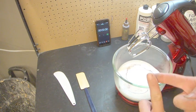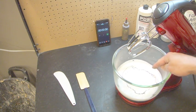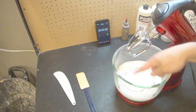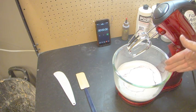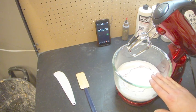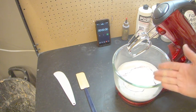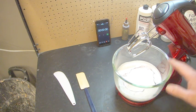There's four things. First is the mixing, just the basic mixing. Because we put the pigment in, when the pigment is evenly through the whole thing, then we know that everything is distributed evenly. So it's a good indicator of that as well. You can run the foam without any pigment, it just becomes white. But I like to do it with the flesh tone, just in case the foam splits or something, and then it makes it less noticeable.